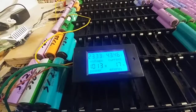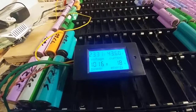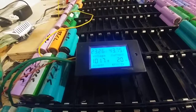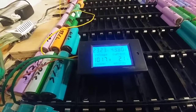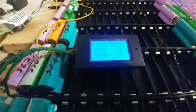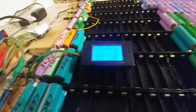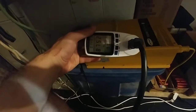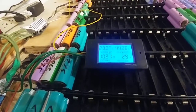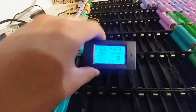Look at that — it says it's a thousand watts, which makes sense, because that's a thousand watts DC. And then it has to be converted to AC, so you lose up to 20%. Right now, with it down at 23 volts, you're probably only at 80–83% efficiency. So this inverter is losing somewhere around 20% of that wattage, which equals out to 875 watts AC requiring about 1020 watts of DC. That's awesome — I should have bought this shunt a long time ago.